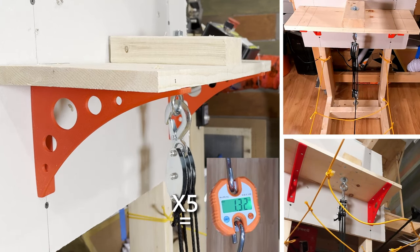The third bracket was similar to bracket number 1, with one side having minimal damage. The top rail had half broken off along the screw holes due to the shelf twisting as the other bracket failed. The bracket that failed sheared off along the backing plate. It seems like a similar issue to bracket number 1, where it broke where the walls met the infilled section.